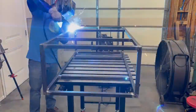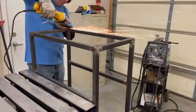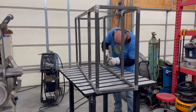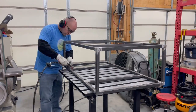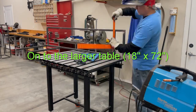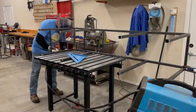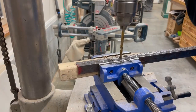Now I'm going around fully welding the joints. A lot of your time is spent tacking first just to get it to hold together, then you test it to make sure everything stayed square and straight. Then you go around and do full welds, and then it's all this work all over again — grind, grind, grind, polish, polish, polish. This little polisher here is blending those welds a bit more. That must have been all the small table — this is the larger, six-foot table. Once you get the first part down, you put the other frame on top, tack weld it, and you're good.